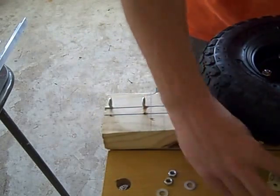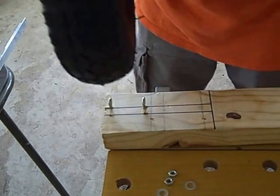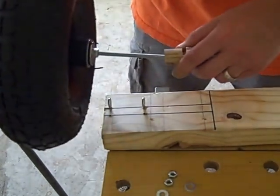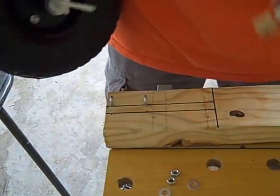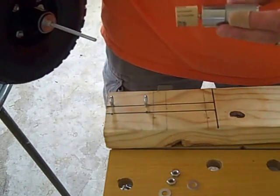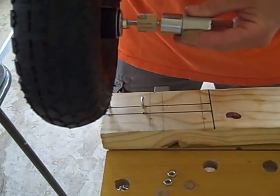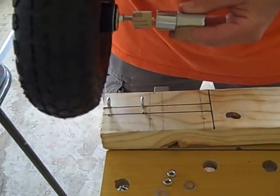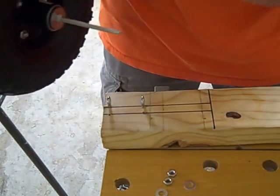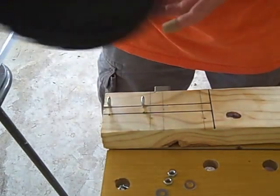As I mentioned in another video, I found a coupler that's readily available — it would do four millimeters to a quarter inch. This cork is helping me model and see how it would work. My initial thought was to mount the motor to the base of the robot with straps, use the coupler, and directly attach the wheel to the shaft. But I realized that would put a lot of stress on the motor shaft and the coupler itself, so I decided I had to come up with a different design.